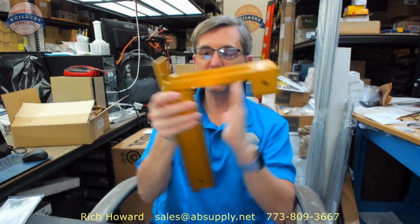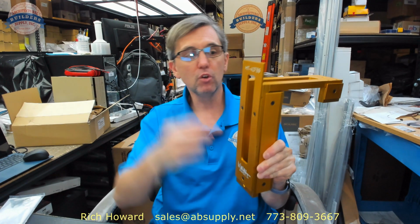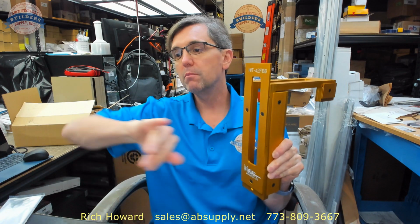If you can get this attached to the corner of the door and you can understand, do this prep, remove it, then do this prep, you're good. If you can understand how to set a router to a depth and the tool is set up correctly, you've removed out of the equation all of the potential for error that I leave in the equation because I may elect to do it a different way.